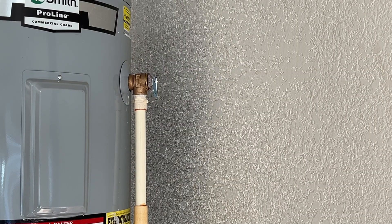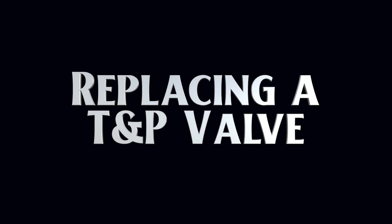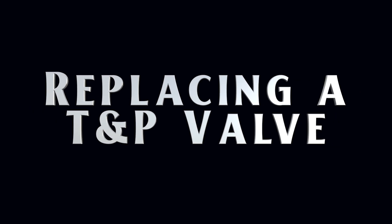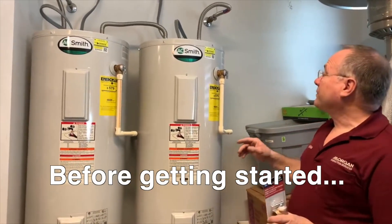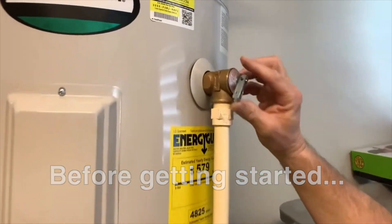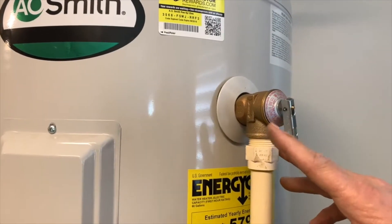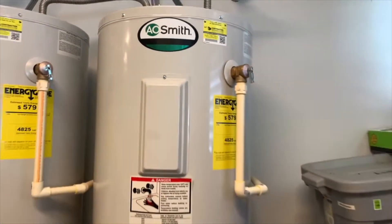If it stops, great — you're done. If it's still leaking after doing that three or four times, you can try it multiple times. I've had several that leaked and it took opening and closing it several times and tapping on it multiple times before it finally stopped leaking. But sometimes it just won't stop. When it won't stop leaking, the only option you have is to replace the valve. When you are buying your new valve, you've got to look at the tag on your existing water heater — it'll show you the specs. This one is 105,000 BTUs per hour, so when you go to the store you've got to make sure you get the same type and same specifications.